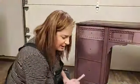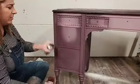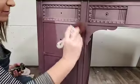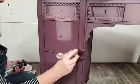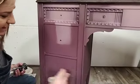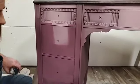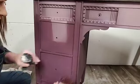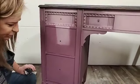Okay. So I'm going to start with what I want to be my dominant color, which is this darker custom plum color. And I'm going to add a little bit of water. The water is just to help my paint glide over the surface. This is the second coat. I already have all my wood covered. I already have full coverage. So all I'm using this second coat for is to perfect my blending. It's not for coverage, so I don't need very much paint. I use very, very little paint, you guys, on my second coat. And I will take these drawers out after we get off camera. Give myself a little bit more water because I didn't get down here. And brush that paint in. And then the water, Dixie Belle's a self-leveling paint, so the water helps your paint level out, and I will get no brush strokes in that finish right there.